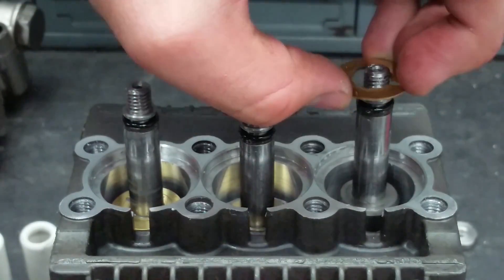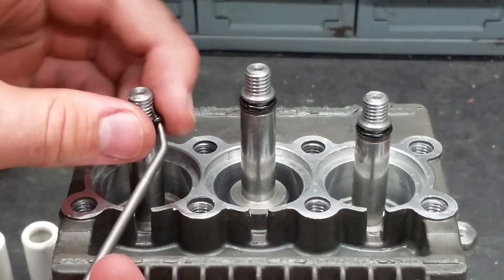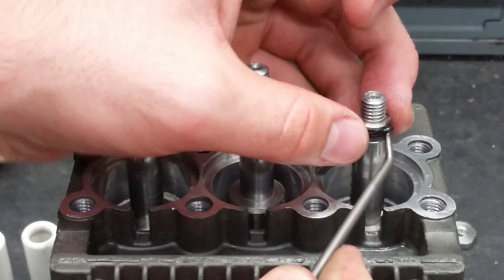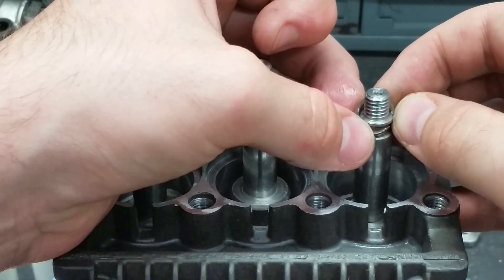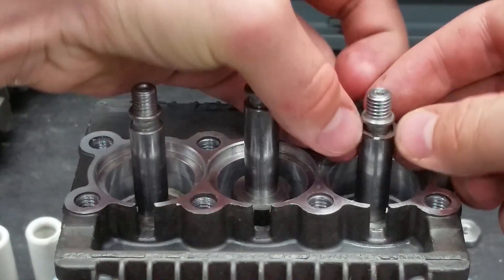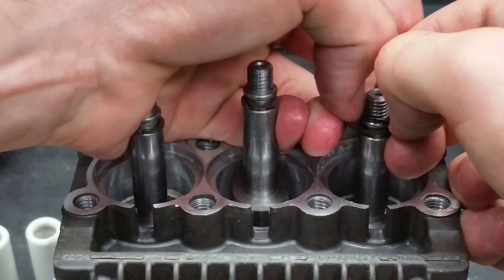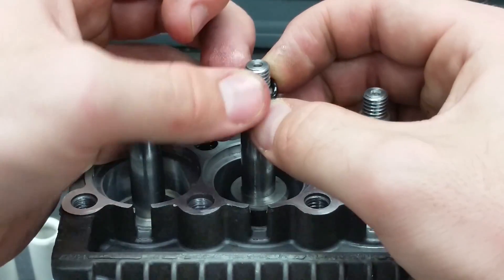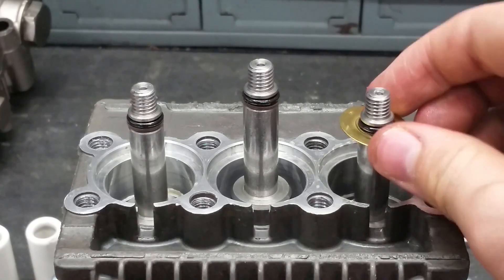With the pistons off, you can now remove the brass slingers. Next, remove the O-rings on the piston rods. Now add on the replacement back-up rings. Roll the new O-rings over the piston rods to put them back in place. Put the new brass slingers into their position on the rod.